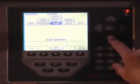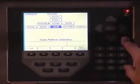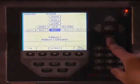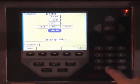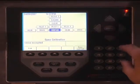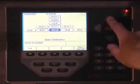Press the down key once to W0, then the right key to calibrate. Press the down key 3 times to display the value of the test weight that will be used. Using the numeric keypad on the 920i, enter the value of the test weight you will be using and press the Enter key. Press the up key once to Plat 1.